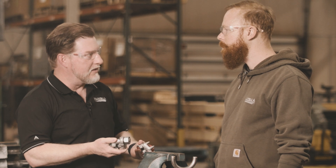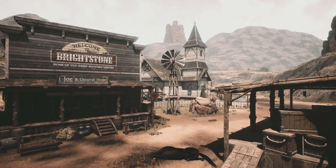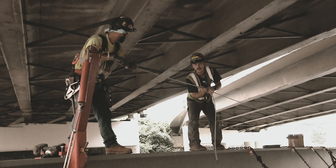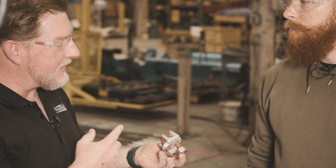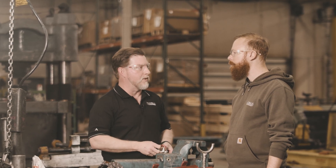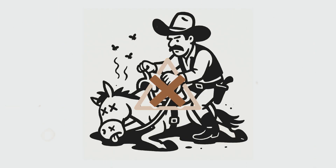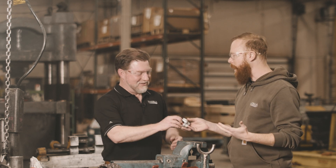Fist grip clips tend to be a little more expensive, but they make installation easier without second-guessing. You may have heard the old adage 'never saddle a dead horse.' When taking wire rope and turning it back on itself to form an eye, people may put the saddle of the drop-forged clip onto the dead end — the short portion — causing damage to the live line with the U-bolt as it's torqued down, leading to possible premature failure. That's probably where a lot of mistakes come in.